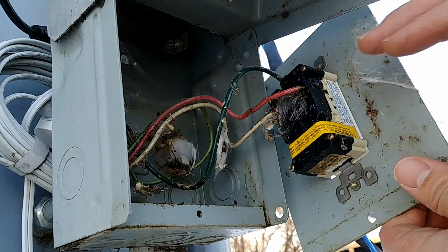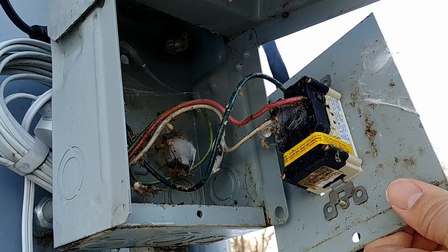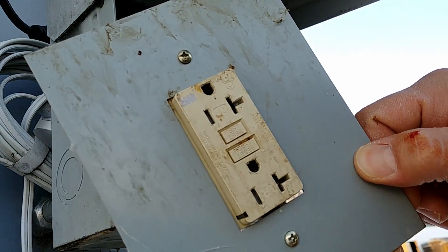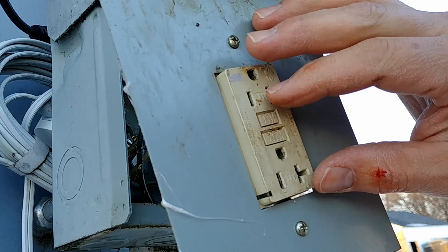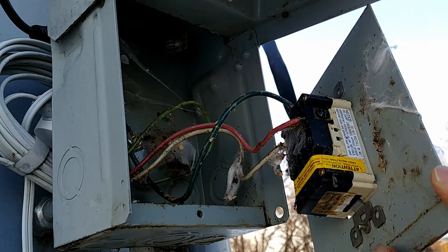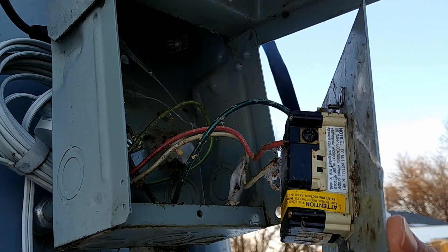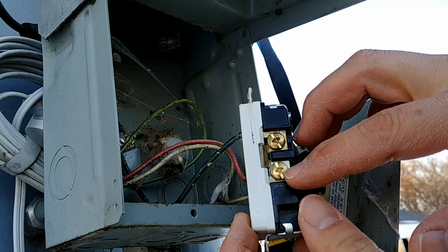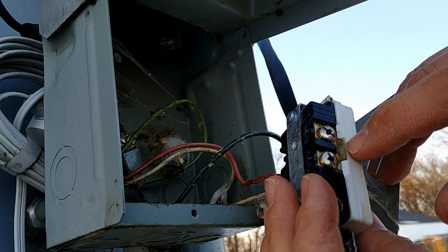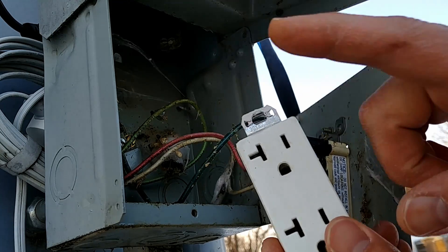In this case it's a nice and simple change-out. We only have wires feeding this receptacle — we don't have anything attached to the load terminals. The load terminals are so that you can hook up additional receptacles downstream of this ground fault outlet, and this outlet would then protect those from a ground fault situation as well. If that is the case, you won't really have to change anything — you'll just attach all the wires, hot and neutral, to your regular receptacle. The hot wires are on this side and the neutral on the other, connected together with this little tab in between, so you will be providing power to all of your downstream receptacles, and they will be protected by the ground fault breaker we just installed.